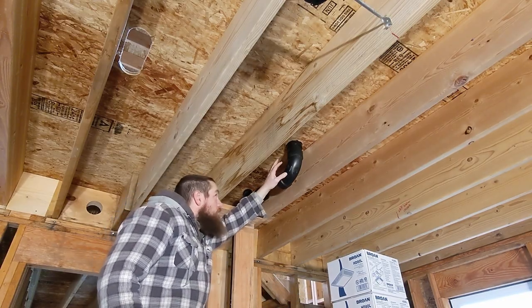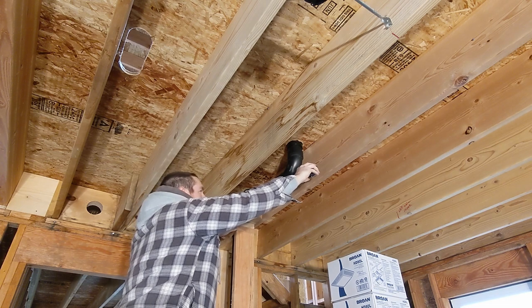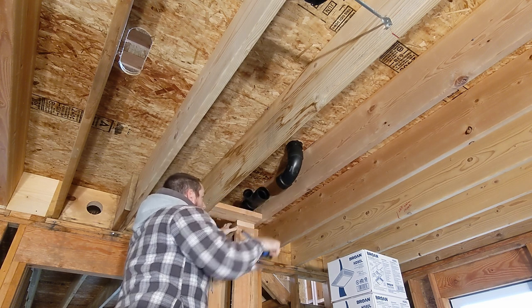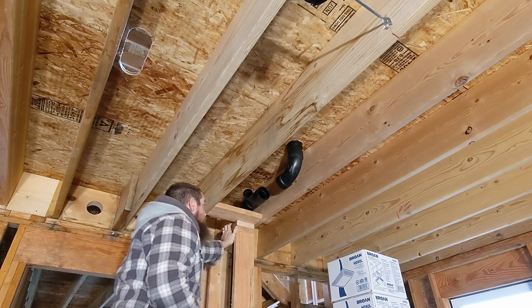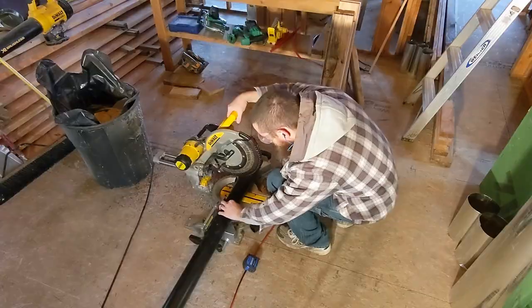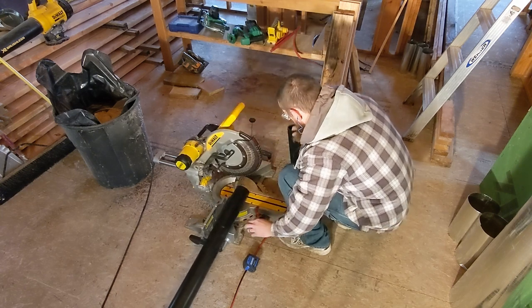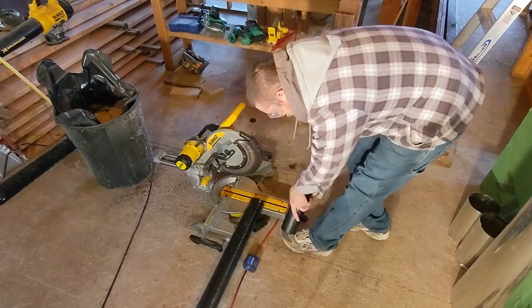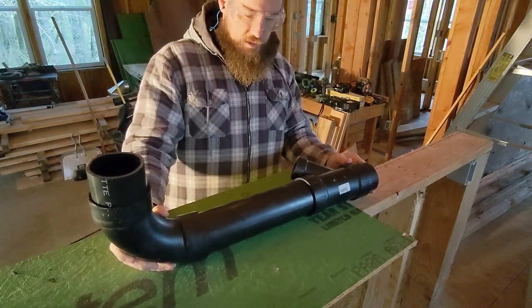So this is just on temp — you can see we're below here where we should be, this will go up. All I'm doing is finding out what this leg needs to be. We're talking about 10 and three-quarters plus three-quarters of an inch, so 11 and a half inches. And then I just got to make sure that's about what I get when I put all this together — it's almost like I get that 11 and a half inches, and this will fit up into there just fine. When this piece is attached in here, we have this just the way we want it — it's got to be slightly uphill.